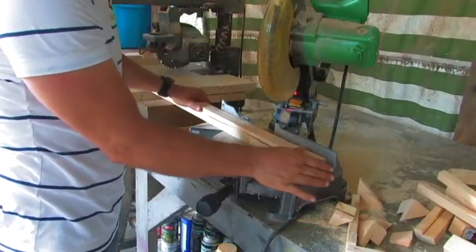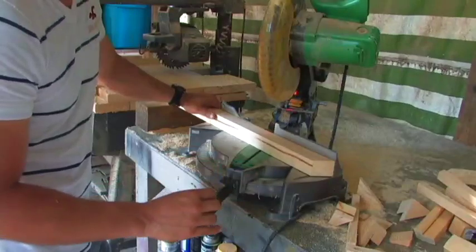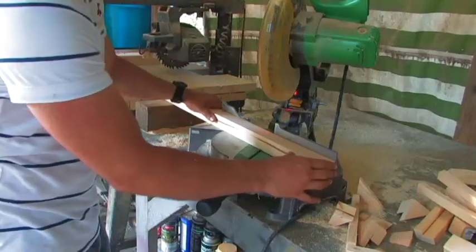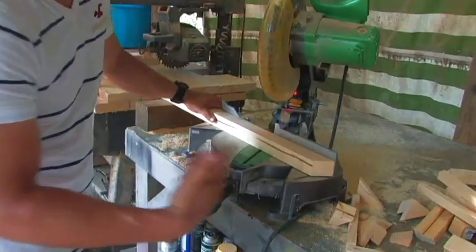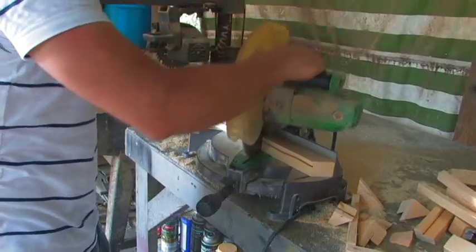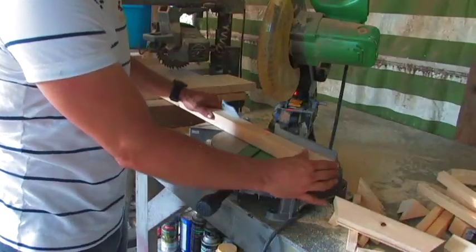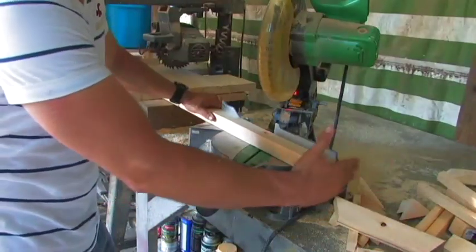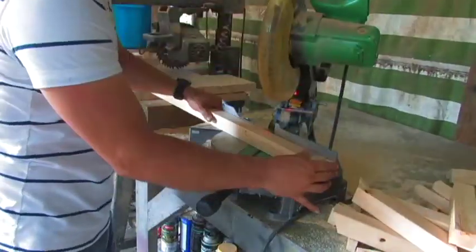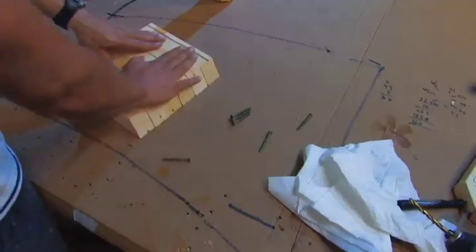What you do is flip your wood and I'm lining it up right to the edge. General rule of thumb is to take the diameter of your parabolic mirror and divide it by three. So you can go a little bit bigger — you can actually go right to the edge. Once you get your first cut you take your wood, flip it and turn it. If you are going bigger than this you should put a stop over here. I have the six pieces set up.